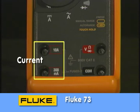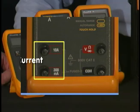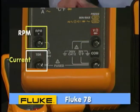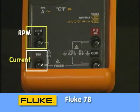You'll also notice that meters have a number of other jacks. For instance, if it has four jacks, it may step up to measuring current — remember those fuses we checked a few minutes ago. It might also have, for instance on the Fluke 78, the capability to measure RPM. You would use that jack to plug in the external trigger input and connect it around a plug wire.